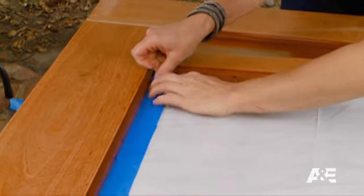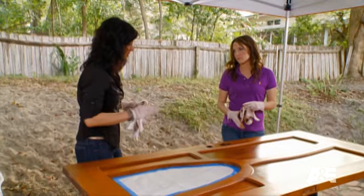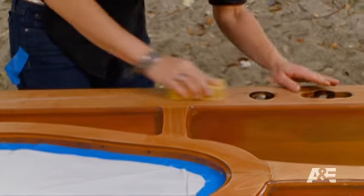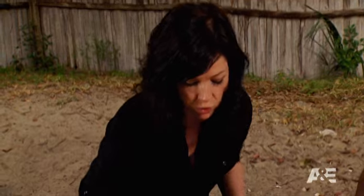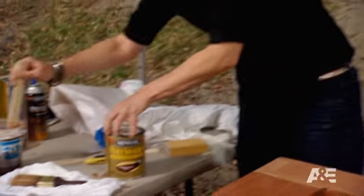This door is beautiful — really a big deal that we're refinishing it. What we did is we sanded it down to the bare wood, sanded out any dog scratches, nicks and dings, and discoloration if possible without going too deep, and filled any places where the joints have started to creep open. Then we sanded it, gave it a fine sand, and now it's ready for stain.